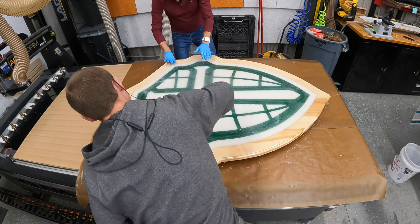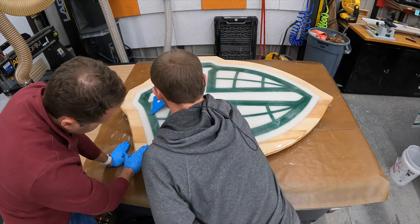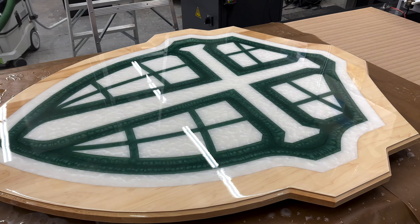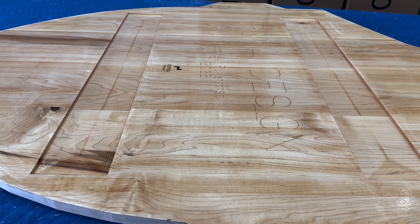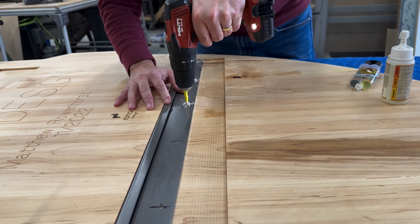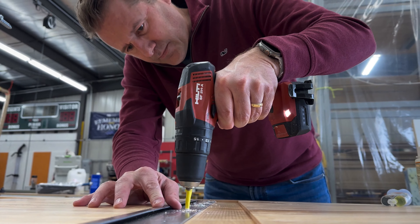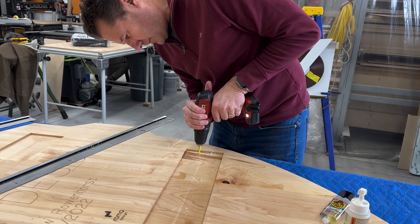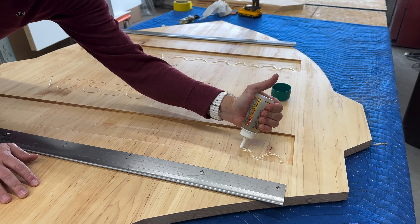Before the top coat I wanted to get the piece cut out. I was running a three-eighths bit but I think this hard maple was too much — I broke a bit. I never turned the camera back on but basically I had to do shallower passes and make the shield a little smaller. Then here comes the top coat, which is Moss Epoxy's top coat product. I'm just spreading it out by hand, making sure it gets to all the edges. It levels itself but it helps to break the edges and push it around — it's always fun to do something by hand like that.